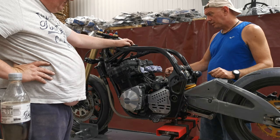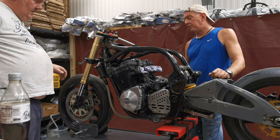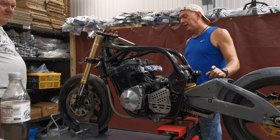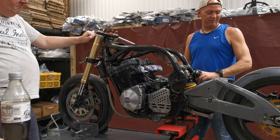We're not going to drain the oil. I don't want to leave a dry engine, so you can get away with it because this is a breakaway frame. So we're going to take out this side of the lower tubes. All the oil cooler and its lines should then come out with the engine. We can stick that on the dolly, shove it over there out of the way, and then Steve-O's going to sort the engine out. That's all him. He's going to dress all this up. And that means I can just carry on with the fabrication. Yay! Crack on.